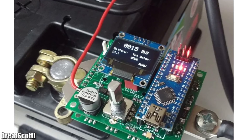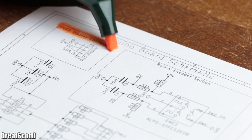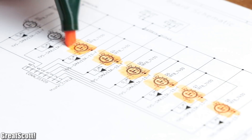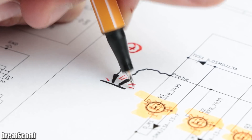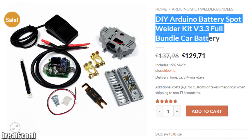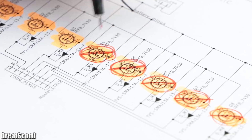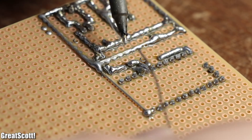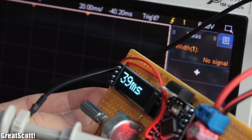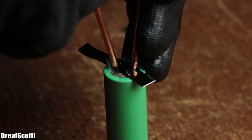What I found was the DIY Arduino battery spot welder. According to its schematic, it uses an Arduino and a few interface components like an OLED and rotary encoder to set the pulse time of the welds, and then it activates a couple dozen power MOSFETs in parallel to basically short a car battery for the length of the pulse duration to create the welds. You can buy this project as a kit for around 130 euro. But I wanted something even simpler without using power MOSFETs as the main power switch, so in this small project I will show you my simplified version which costs around 90 euro and might not deliver the most consistent results, but still works well enough.